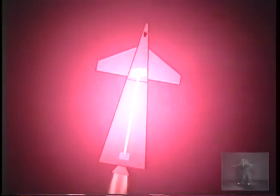Suppose the vehicle strays slightly off path. Immediately, the autopilot sends an error signal to the servo controls. This mechanism supplies power to properly position the gimbaled booster engine, thus correcting the error. The autopilot also has another function, controlling the vehicle so that at a preset time it rolls out toward the programmed trajectory. After the rollout is completed, the booster engine burns out and separates.